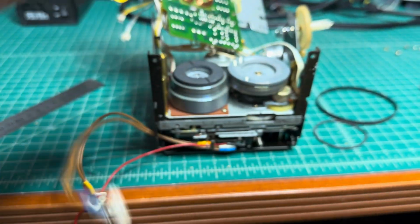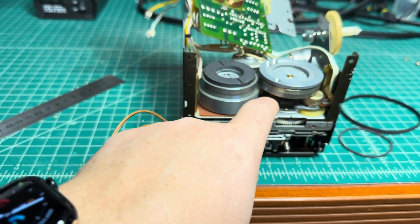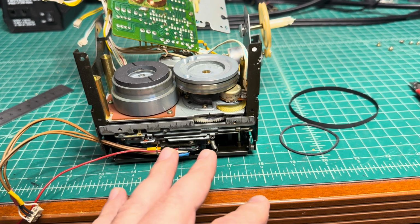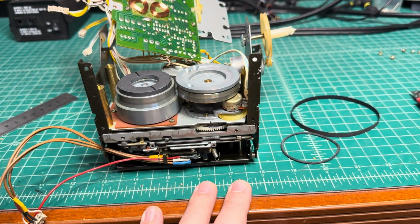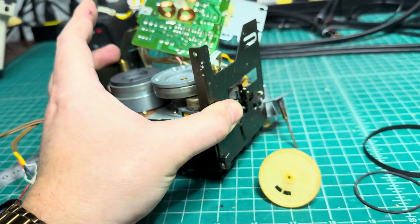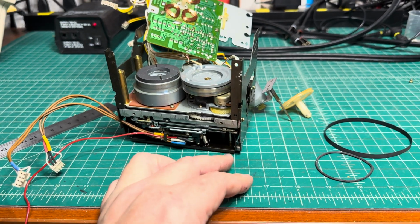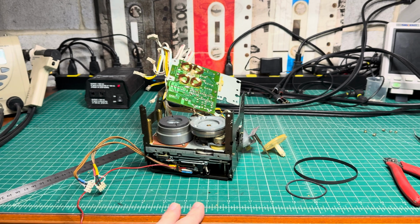And there will be a couple spots when I remove the capstan. So there are a couple spots when we can get access and lubricate this gear, so it will start moving smoothly and easily. And then we'll get to the front side. I believe like everything should be good except the left pinch roller arm, all right, which requires a new arm now and pinch roller. All right, let me work on it.